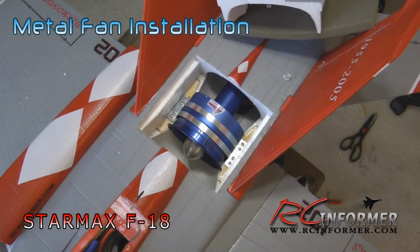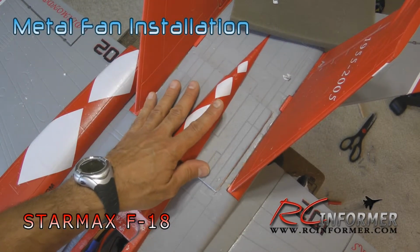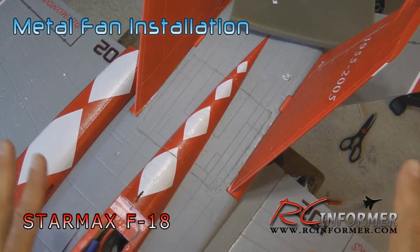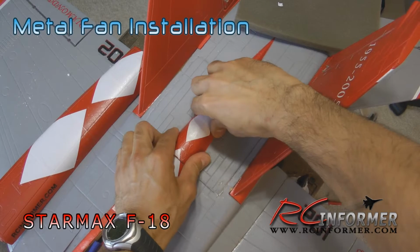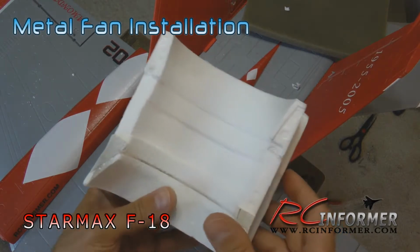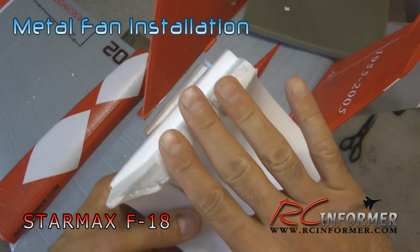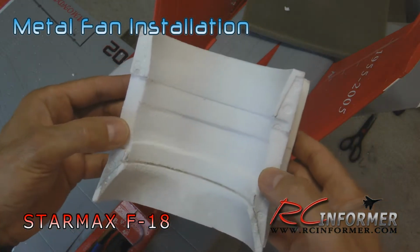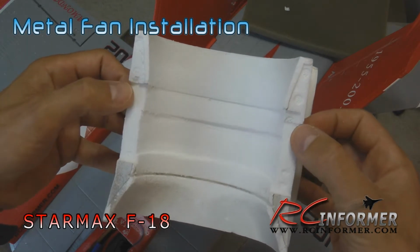The next thing you're going to want to do is take your top cover and put it in place, and wiggle it around to get it on there. If it doesn't seat all the way down, now that you have it finally installed, here's where you're going to make any additional trim changes to it. If it doesn't go all the way down and you press it in there, a lot of times you'll see little indentations right here where the screws go, and you may need to file a little more down here, a little more here. Who knows where you need to file, but you want to try and locate what parts are keeping it from going all the way down. The biggest parts I found, again, were right here on both of these sides.